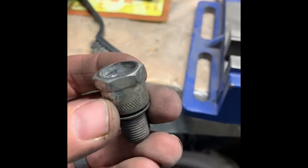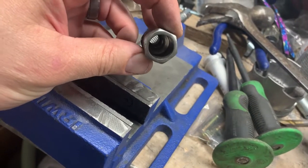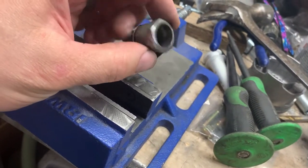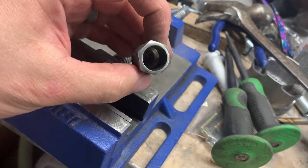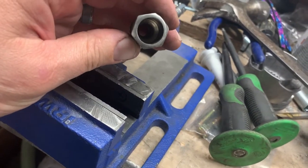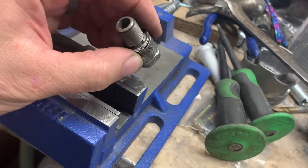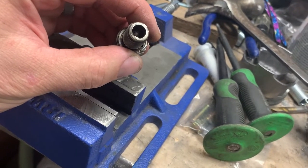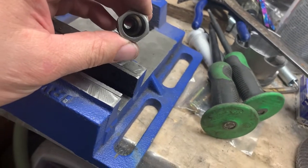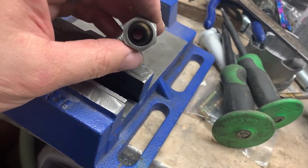I've cleaned this out really well with my Dremel wire brush attachment, so I've got nice clean metal. Basically I have a spark plug body I'm about to fill up with weld. I'm going to start at the bottom bevel and fill it all the way to the top, flatten it off, and then drill from this side to the size I actually need. It's pretty easy to just take the MIG welder and shove a bunch of wire in there.